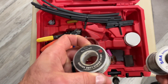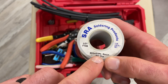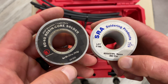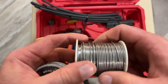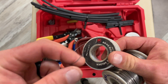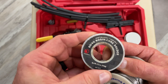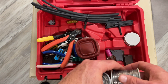These are the two solder sizes I prefer, and you always want lead solder. Don't ever buy non-lead solder for electronics and wire repairs — you just can't beat the performance of lead solder. These two sizes are what I prefer: one is better for wires and one is better for boards. You want a rosin core. With electronics, it's very important that your flux not stay active. If you try to use plumbing flux on a board, the board will corrode. You've got to have rosin core for doing wires and boards.